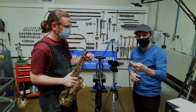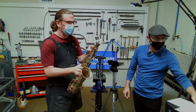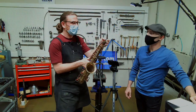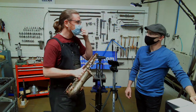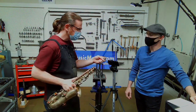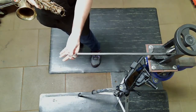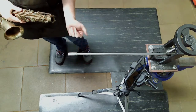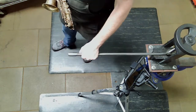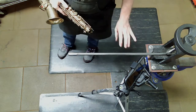That is the alto saxophone. The reason we use a slotted dent barrel is because the body pip actually protrudes into the body. If you were to take a solid barrel and jam it in there, it would do damage to that pip inside - which happens quite a bit. That's why we use a slotted dent barrel.